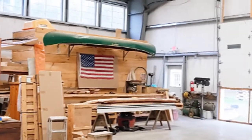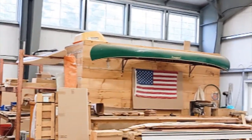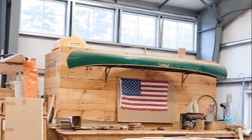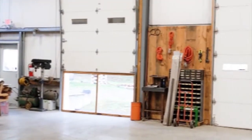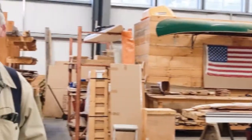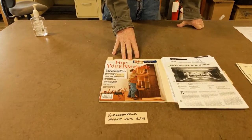The pine box has two 1,000-gallon propane tanks full of water as a heat sink. When the zone calls for heat in the floor, it pulls off that 2,000 gallons of water. I don't know how many dollars I saved by burning wood rather than oil, but I also spent the bulk of my life cutting, splitting, stacking, and orchestrating firewood. What I'd like to do now is talk about the different styles of production of veneer.